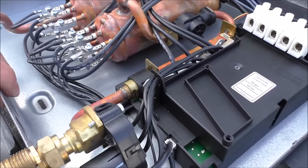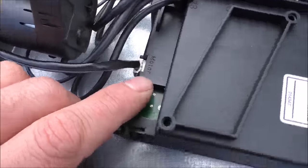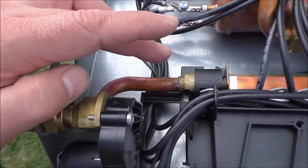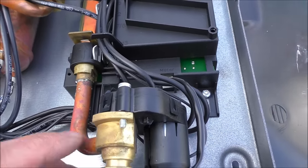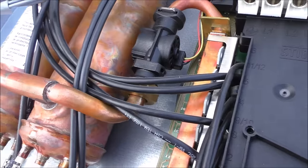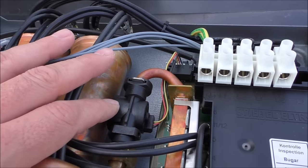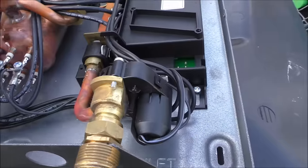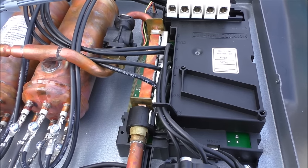Here's what I think is wrong with this old unit — it's this pressure switch right here, where it says motor. I think this needs replacing. There's not a whole lot to it, but it's out of warranty so I'd have to buy the part. This other switch right here could be bad also. That's really the only thing that can go wrong with this thing. When water comes through the cold inlet, that's what triggers the heating system to come on. It's pretty simple. Sort of like a big Keurig, if you know what I'm saying.